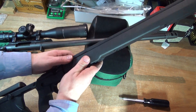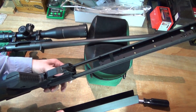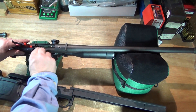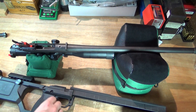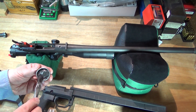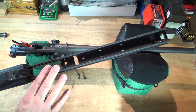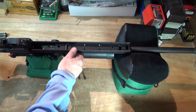On the chassis, we need to remove the fore-end — the plastic portion. That's a pretty tight tension fit, and removing it reveals the chassis underneath. With the action out, there's also a good chance to wipe everything down. One disadvantage of living in Arizona is sand gets in places you'd never believe. KRG recommends lubricating your action screws with heavy grease, so I'm going to use just a touch of AeroShell 33 armor's grease on the action screws — just a real light coat. With the fore-end removed, we can set this on here, make sure the trigger clears, and the recoil lug slips right through.